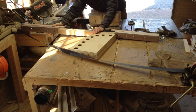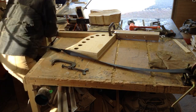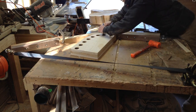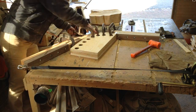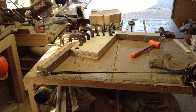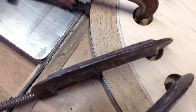This is actually my second attempt — I don't show the first one here; I released a video last week where I show that first bend. It failed mostly because my bending jig was made improperly the first time. Once I have the piece in the jig, you can see I'm using a winch — this is a much easier task with two people, and the winch makes it almost like a person and a half. There are a lot of forces involved in bending lumber this thick. I got the winch at Harbor Freight; it was cheap and worked perfectly for this.